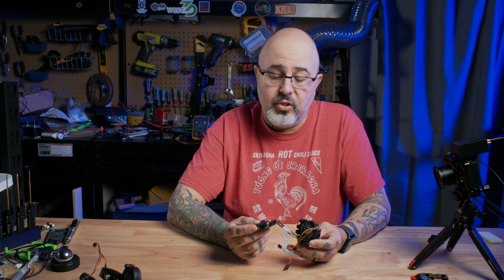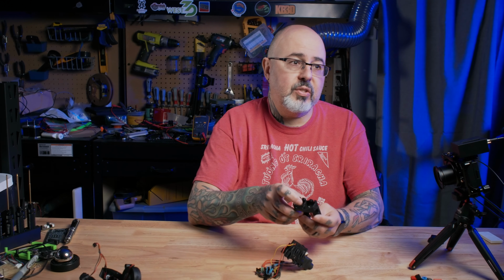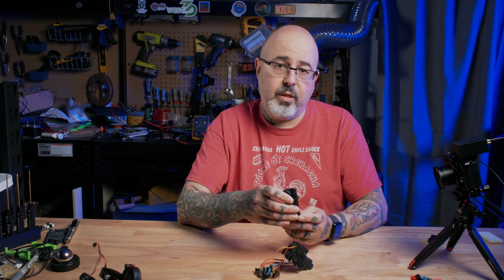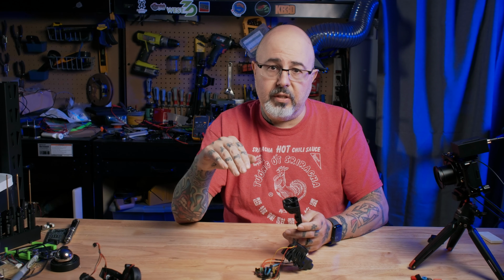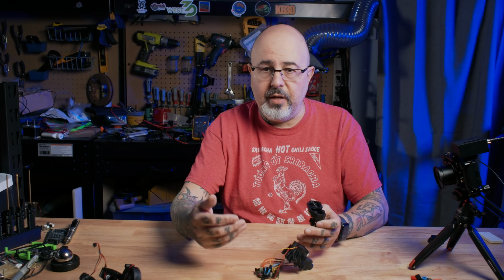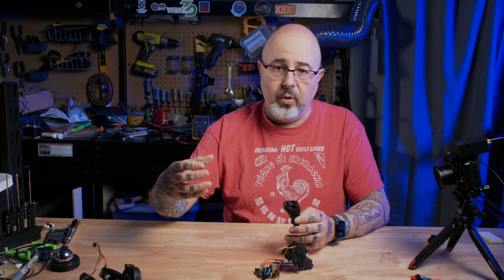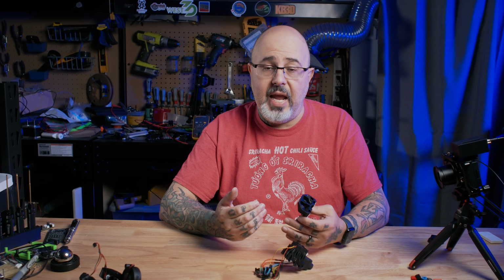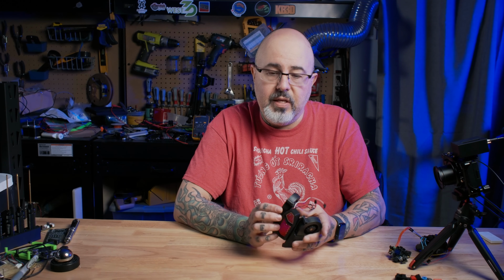One of the caveats with the TAP mounting system is that the carriage has to be slid up from underneath. Because of that, there's not enough room for the extruder to clear the X-beam. So essentially, I have to take the entire thing apart to remove it. If you're using the APDM carriage system, it slides down from the top and you can remove the entire tool head in one piece, which is great and convenient, except I use TAP because I have a mag bed, so I live with compromise. And finally, we have the cooling ducts.